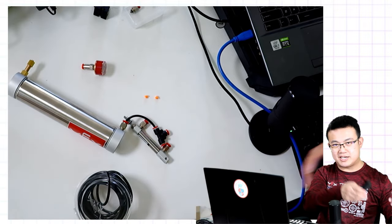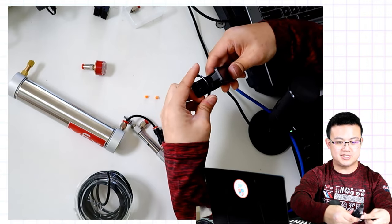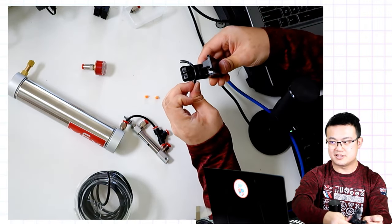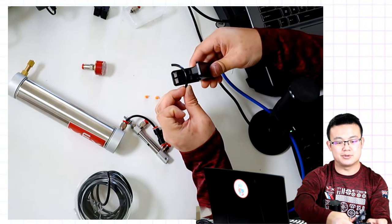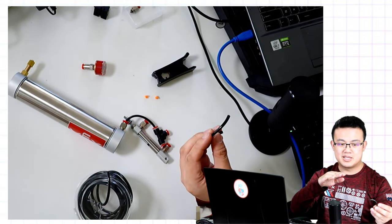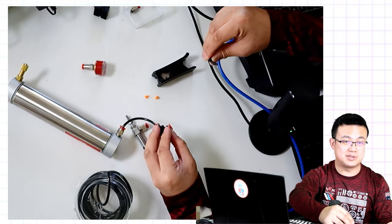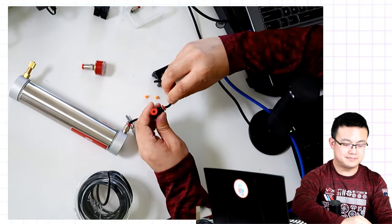Just make sure when you're cutting tubing that you are cutting straight and that the tube is completely settled in the groove when you're cutting. You don't want to cut it on an angle, because then it might not attach really well onto a fitting. Okay.